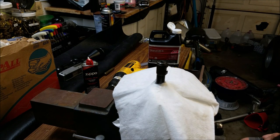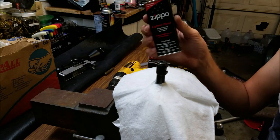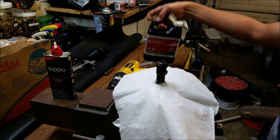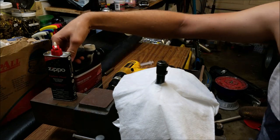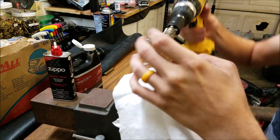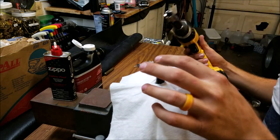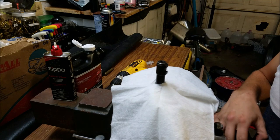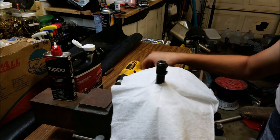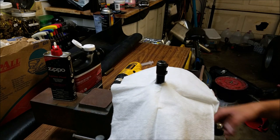You're going to need two different types of oil to do this. I'm going to use some motor oil for the inside of the barrel, and then we're going to use cutting oil on the actual tool itself. The motor oil goes inside the barrel and on the pilot to keep friction away from the inside of the barrel. The cutting oil goes on the cutting surface and the outside of the barrel to help keep the tool nice and cool so we get a good clean cut and don't damage our tool.